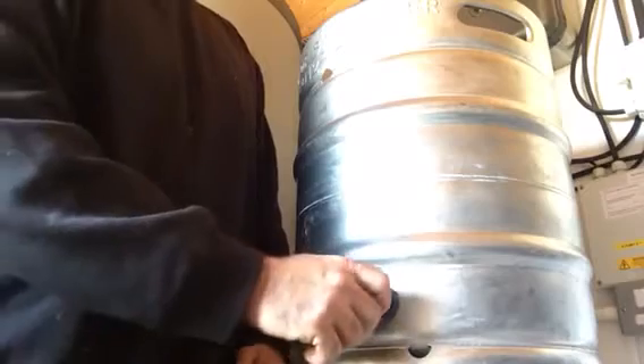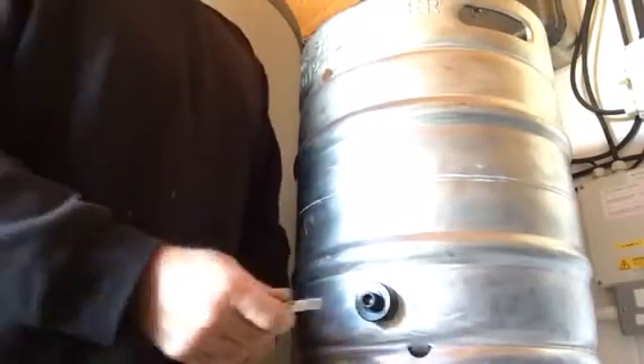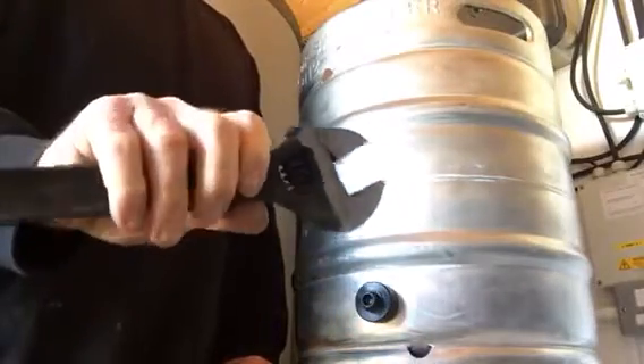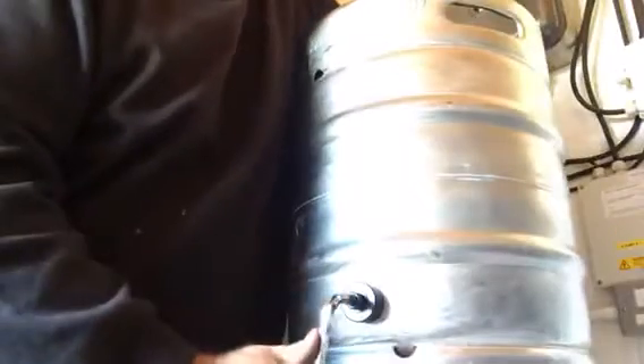Right guys, back again. I've drilled the hole — apologies, I said it was 10mm, it wasn't; it's 12mm, so I drilled the hole out to 12.5mm. It takes a 10mm Allen key, or an Allen socket obviously on the front, and the flats on the back take a 26mm spanner. You can also use an adjustable wrench tightened down onto the two flats. Basically that's in there, and the cutter is in the back of here.